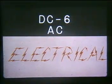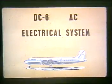This United Airlines flight training center presentation covers the DC-6 aircraft AC electrical system. To convert direct current to alternating current, rotary inverters are installed to furnish 115 volt AC 400 cycle three-phase power. A small vibrator-type inverter furnishes 110 volt AC 60 cycle single-phase current with sufficient power to operate five electric razors. The AC electrical system varies slightly between the Group 1 and Group 2 aircraft.